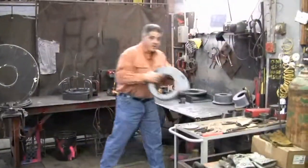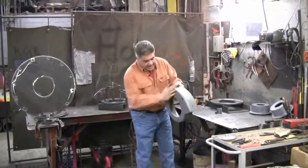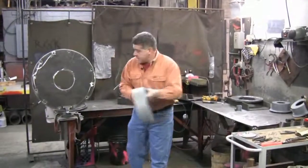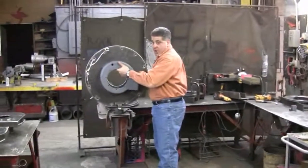This is the air turret on the Inferno Therm burner. As you can see, it's made out of quarter-inch steel, rolled, fitted, machined. This spiral is what creates the high-pressure zone when the air comes around and shoots down a fire tube, which gives us the efficiency of scale with the Inferno Therm burner.